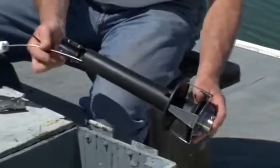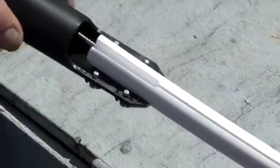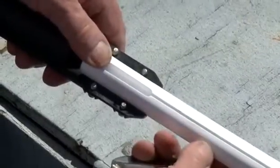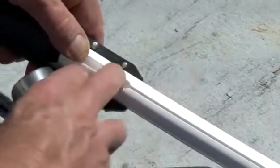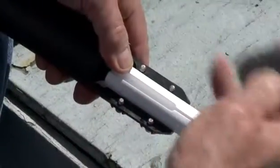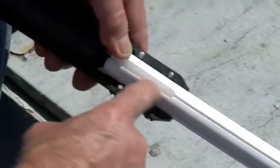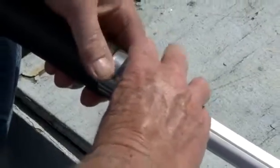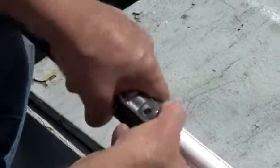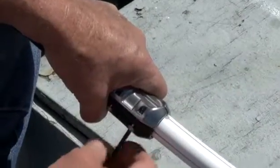With that done, we can lower the turnbuckle into the tube. We slide the torque tube and drum unit up — it covers the front side foil and then the stainless steel clamp feeder will cover the back side where the slot was cut in one of the extrusions. There's a keyway right here that matches up with the slot that's been milled in the extrusion shape. That goes over like so, holding the pieces together, and we re-tighten the fasteners in the torque tube.